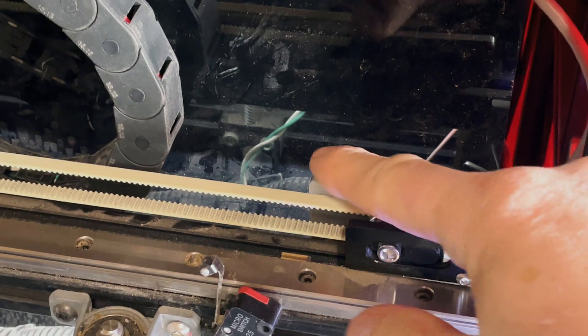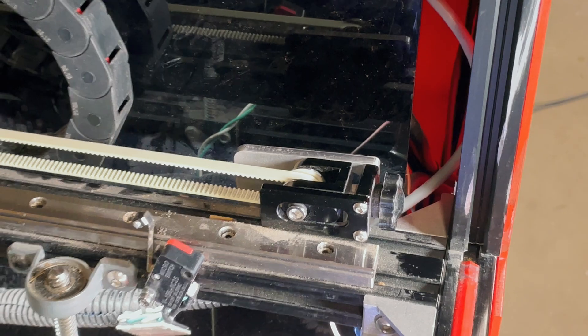As much as I like this laser, there were some things I really hated, and some I've already fixed, but definitely some are still in the laser and I live with them. First on the list: some of the mountings. I used a lot of acrylic — in part because you can use the laser to cut the parts. For things like the belt tensioners, I used four-millimeter acrylic and thought it would be good enough. Well, it turns out that four-millimeter acrylic does flex, and when you're tightening down the belt with even moderate tightness, you can see the flex and the belt isn't running in line with the pulley. I hated that. So I got some quarter-inch aluminum plate, took those same designs, put them on my CNC, and cut out metal versions of those parts. That solved a lot of weird oscillation and vibration in the laser and allowed me to get better output and go a bit faster.